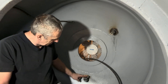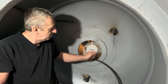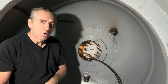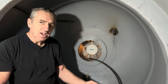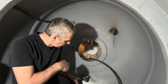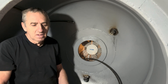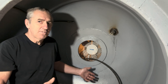Next thing to talk about is the release mechanism for my emergency drop weight, right down here. There's one of these fittings welded in, then a big stainless steel plug that goes into the fitting — bored out and machined with an O-ring groove. Inside is a stainless steel shaft with a big nut on the inner end, and on the outside the shaft is threaded into a nut welded to a heavy steel weight. When I want to release the weight I just turn the shaft and eventually it unthreads out of the nut and the weight falls off.